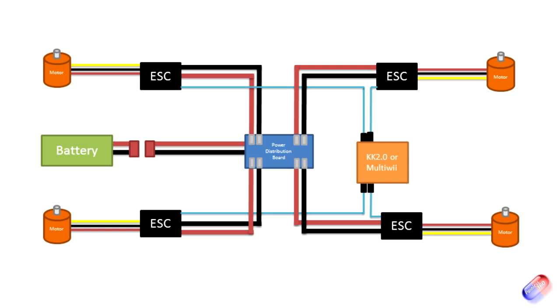If any of those motors are running the wrong way — clockwise versus counterclockwise or vice versa — it's very easy. All you do is swap any two of the three wires going from the ESC to the motor and that will change the direction of spin. Once you've done that you're ready to put your props on and start tuning and setting other bits and pieces up. Hopefully that's easy to follow and makes sense. Good luck with your build and happy flying!